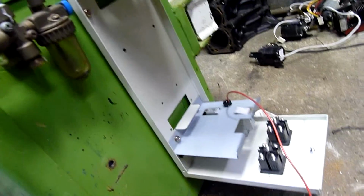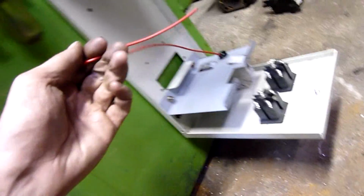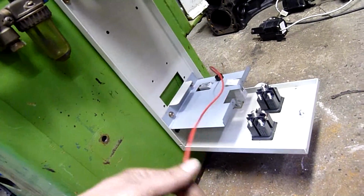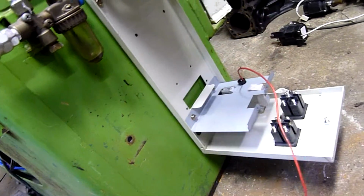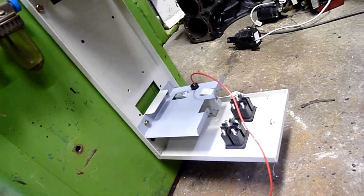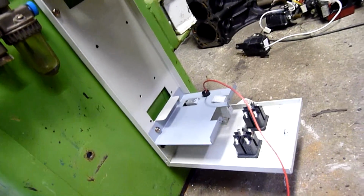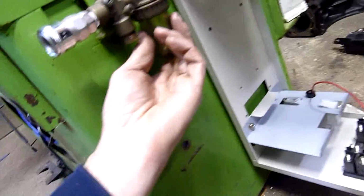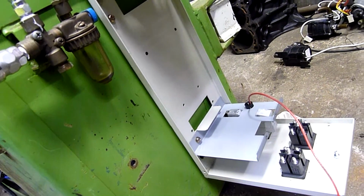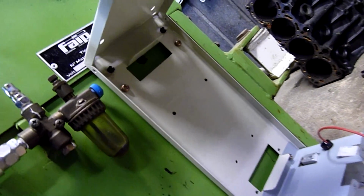As one of my subscribers pointed out, they can burn out pretty bad and it would be a bad idea to have it inside here with all the pneumatics. Better off have it in its own metal box on the back of the machine. Always good to be safe, especially because it's going to live out in the carport with this other stuff that can burn. At least if it's inside here, it's got a chance of tripping out and shutting itself off, and the air holes aren't big enough to really allow serious flame propagation, so it'd burn the box, but it wouldn't destroy anything else. I'm not 100% sure how well rated those drives are as far as fire retardation goes, but I'd be willing to bet they're not that good. Not being very cheap China stuff.